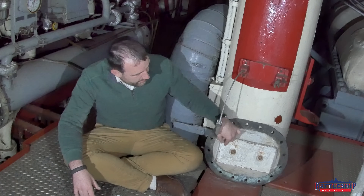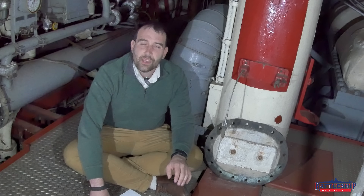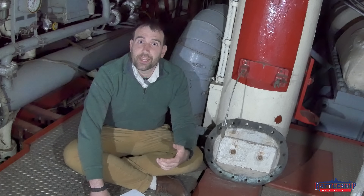These little bricks of zinc are bolted on the exterior of the hull. They've just got these two bolt holes. The studs are welded onto the hull — you put the plate on, you bolt them on — and it's very important for this working. This is part of our passive cathodic protection system.